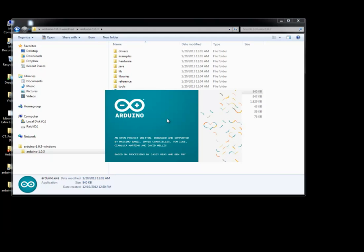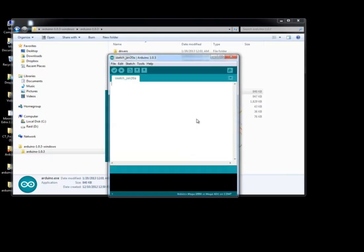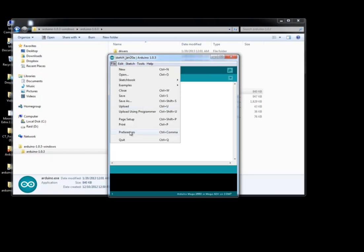Now, as you know, with Megapirate, we're going to be using a combination of a couple of different configuration programs. We're going to use Arduino's SDK environment to upload the firmware to the board, but we're actually going to use Mission Planner, which is available from the Ardupilot Mega site, to do the rest of the configuration. So this entire process is just to get the firmware loaded onto the board. So that setting that I mentioned earlier is going to be under File and under Preferences.